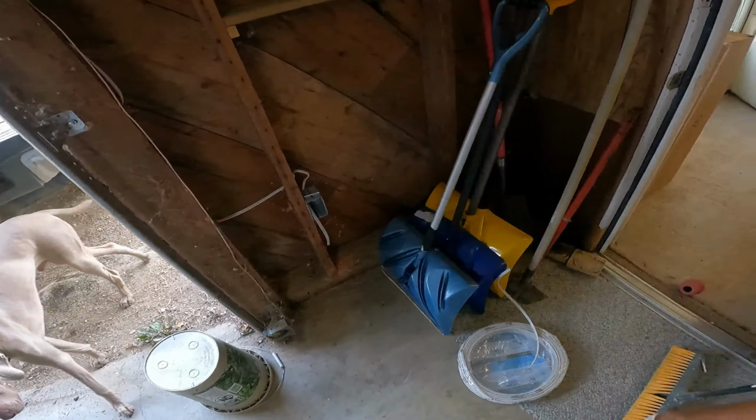All right, second step is actually insulating. There are more steps after the second step, but second step is actually insulating. So what you gotta do is measure how tall and how wide your studs are. This particular garage is built 24 on center. I think that's pretty common for most garages. And we just gotta measure how high up we gotta go, roll out our insulation, cut it, and then lay it up in our stud cavities. So that's what we're gonna do now.